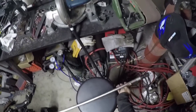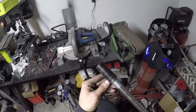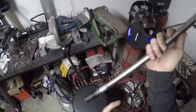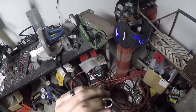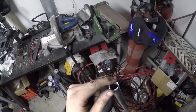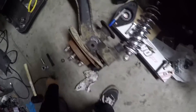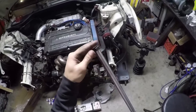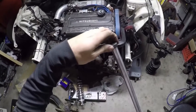I jammed a 19 millimeter socket on here, and basically what that allowed me to do is connect my impact to it. As you can see it's kind of rusted from sitting around. Now this is 3/4 of an inch and the inner bore is exactly 5/8, which is really nice because although these threads aren't very clean, this bolt fits perfectly — it can rotate but it can't wobble at all.